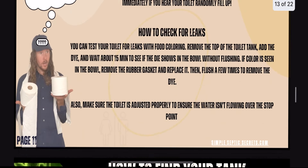We'd already pumped the septic tank about two weeks before and the owner said go ahead and put some risers on, we'll just leave it dug out. So we've got just about all of it — we're finishing up with a flat shovel. I'm going to test it and see if it fits. That looks like a good fit, and once we have it in there where we want, we're going to go ahead and trim it up.